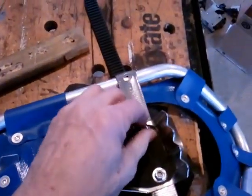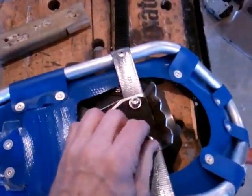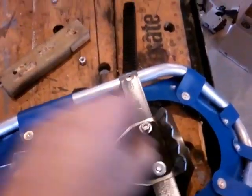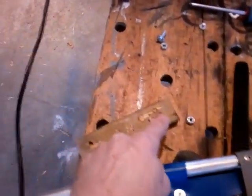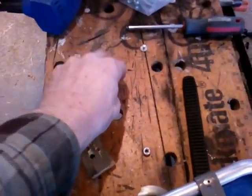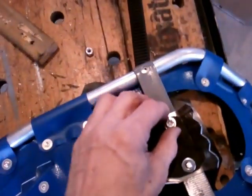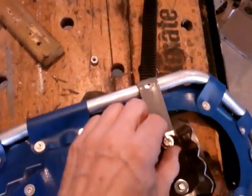On the back side I've got my lock nut. One of the things you'll notice is I'm missing a washer. What happened was I was drilling out a rivet using this piece of wood, and the piece of wood snagged on the drill and went like this, hitting all my washers just like a little pinball arm — and they went all over the garage. I've looked a couple of times and I can't find them, so I'm just going to use regular washers. It's not too critical because we're using lock nuts.